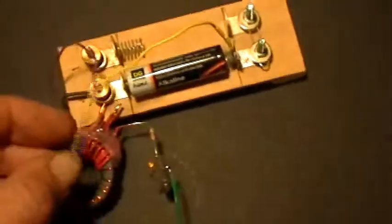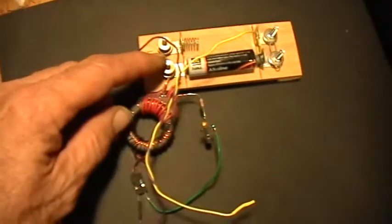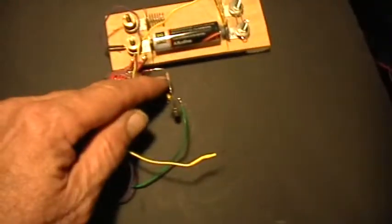So that's the transformer part, and I've followed the exact verbal directions that I gave in the forum post here. I take the coil with the lesser number of windings and hook that to one end of the coil with the greater number of windings, and both of those points go to the positive end of the battery. The other end of the coil with the lesser number of windings goes to a 220 ohm resistor.